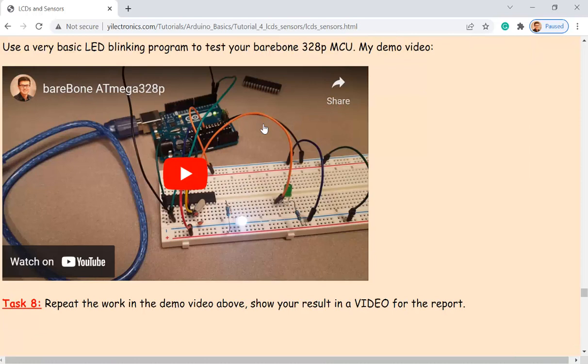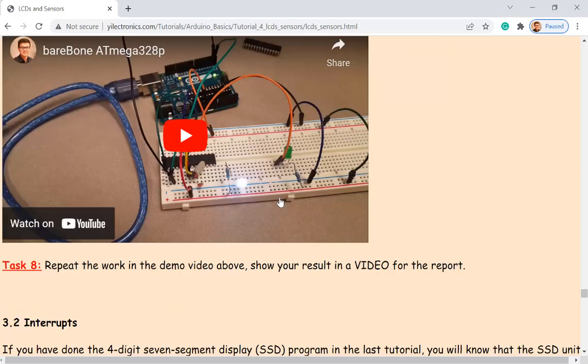So in that case, you can imagine that when you are designing a PCB which has a microcontroller on it for an application, you always want to leave some of the program pins on the PCB, so you always have the capability to program it afterwards, right?